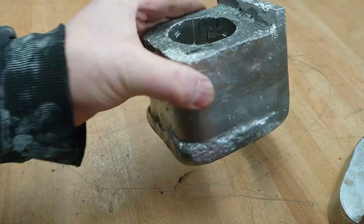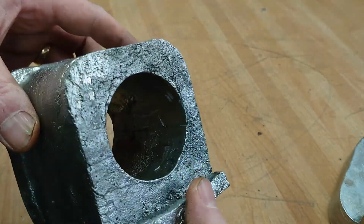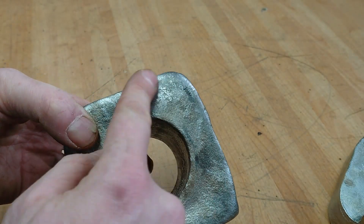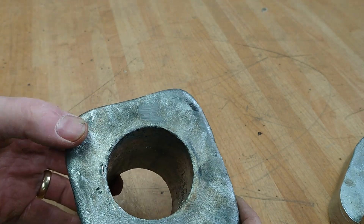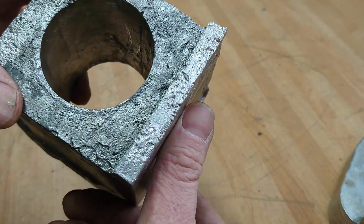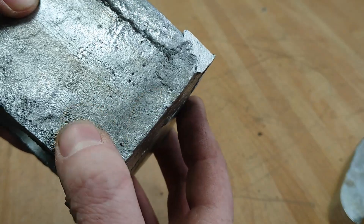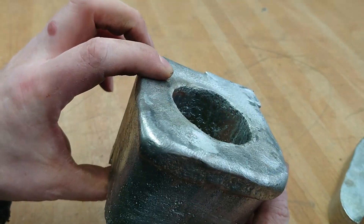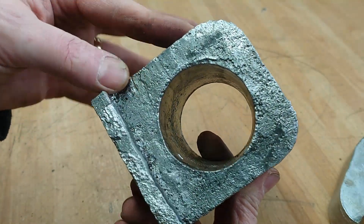This one has come out a lot nicer, just generally surface finish wise. There are still a few bubbles and pitting, but being poured open that's to be expected — I'm quite pleased with that one. This one is kind of grotty inside — bubbles and pitting — but I've got five millimetres to take off all round to take it to size, so I'm hoping it'll clean up quite nicely. The outside is pretty grotty too; I think a lot of that is just the mould wasn't very good, loose sand and so on. But there's a lot of draft on this so there'll be a fair bit to tidy up. Unfortunately the better looking bit is the top with the most material, and the worst looking bit is the bottom, but there we go.